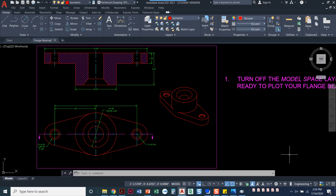Now that we've got all the views drawn — front view, top view, with dimensions, section views, and an isometric — we're going to take it a little step further and do a section view of the isometric. This is kind of tricky because it's an isometric, but we've got so many counterbores and a countersink.